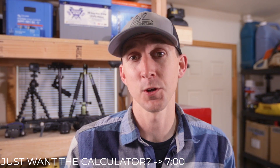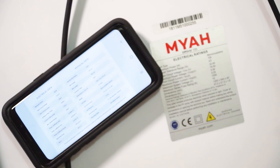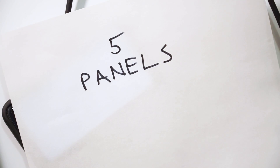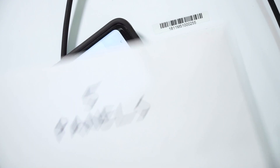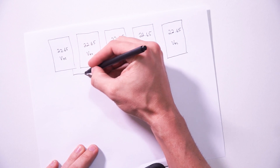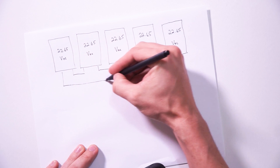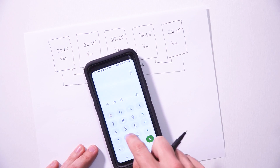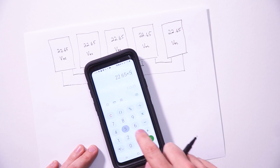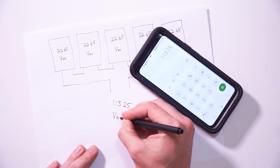The first thing you're going to need is the specs of your solar panels. These can usually be found on their product page or simply on a sticker on the back of the panel itself. For this example, I'm going to be using this Maya 100-watt solar panel with these specs. You'll also need to know how many solar panels you have in your array, and for this example we're going to assume that all of your panels are wired in series. Now if you're thinking critically, you may look at your spec sheet and think: I need five of these 100-watt panels, and my open circuit voltage is 22.65. I'll multiply that by five and the most voltage I can ever expect to see coming from my solar panel array wired in series should be 113.25 volts.